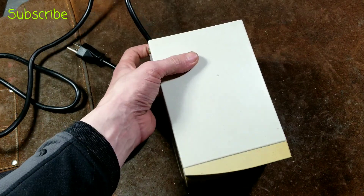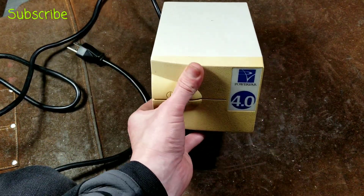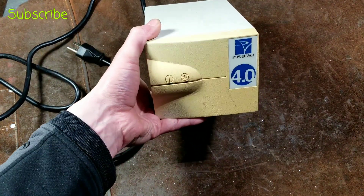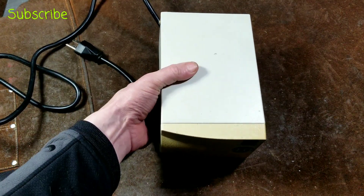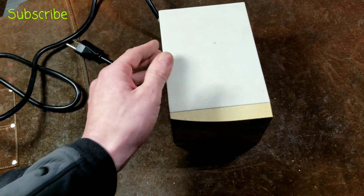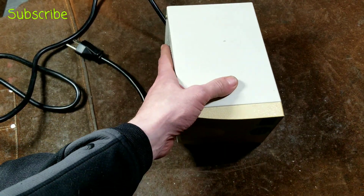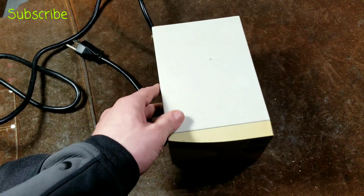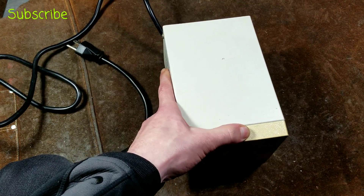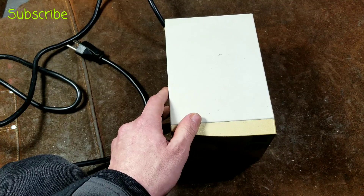I talked a lot about what they're used for, and that's the general deal, so people are a little bit more aware when they see something like a big, heavy power conditioner like this. It may actually be one you want to pick up, because it works like filtering circuits on a high-end surge suppressor, except that because you have this huge isolation transformer, it really filters out basically all the noise — it is super-duper quiet and ensures you have super-clean power.